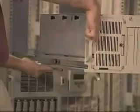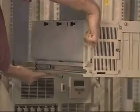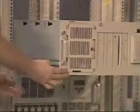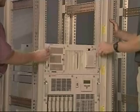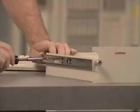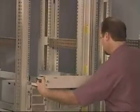Load the workstation with at least 2 installers into the rack by carefully aligning the workstation's component rails with the rack bracket rail, sliding it in until it catches on the latch. Press the release lever, slide the workstation the rest of the way in, and attach the 2 thumb screws. Again, use this same procedure for other standard slide rail components like the keyboard tray and switch boxes.